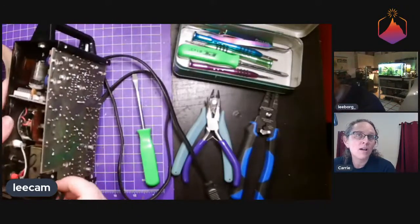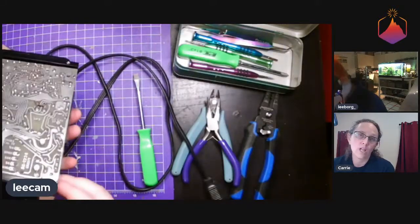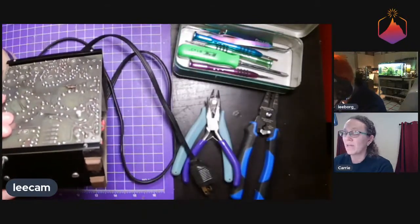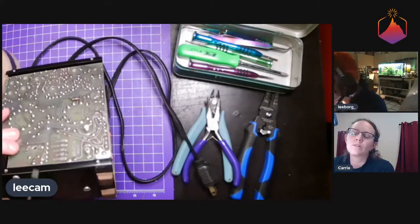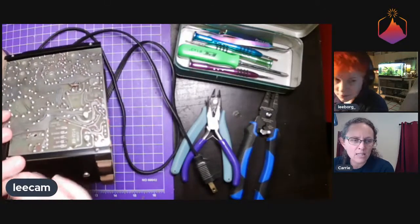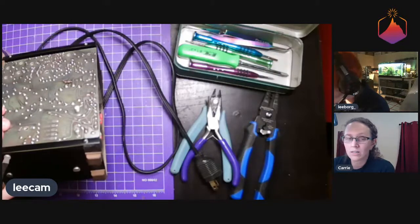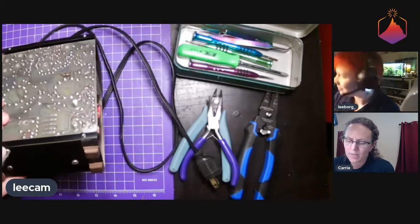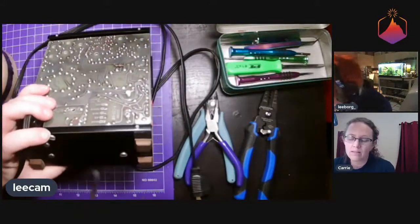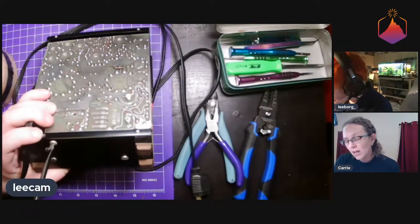I have etched my own boards using etchant and ink as a resist. Oh, cool. That was a long time ago, but we actually used one of those little Shoreline, I think Shoreline is the brand, CNC mills. They were one of the first tiny desktop CNC mills, and we basically put a pen in there. It was a specific type of paint pen. I don't recall exactly the type or formulation, but it was specifically used as a resist. And so we plotted the traces.